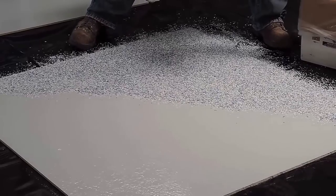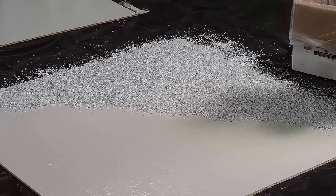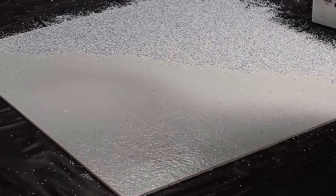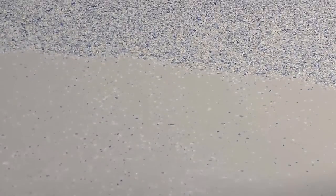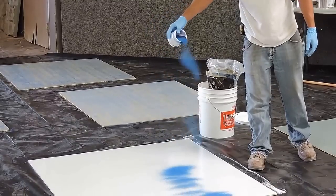Yeah, it's quartz. It's colored quartz sand, right? What's that? This one is quartz. Those are chips, vinyl chips. Yep. The quartz that we're going to show in a minute is really good. It gets used a lot in commercial kitchens. When you throw the quartz, your top coat you want to be an epoxy, a clear or a colored epoxy, depending on what they're asking for. But usually, it's using a urethane as a top coat. On this one, you can use either a top coat.